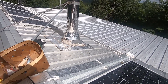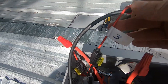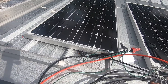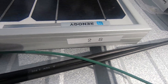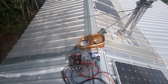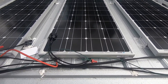We're back on the roof. I want to show you what I use — car automotive inline fuses. There's something important to notice: I've got it labeled three, and there's two. I've got labels one, two, three, four going back to the combiner box. If I ever have to troubleshoot these panels once all this wire is covered up, it's going to be tough to troubleshoot without those labels.